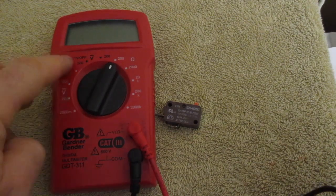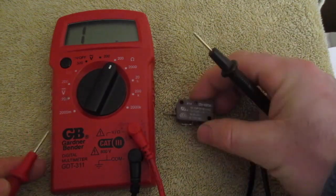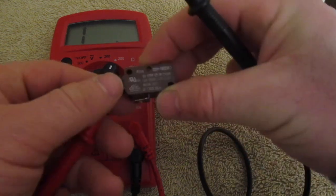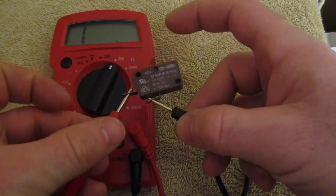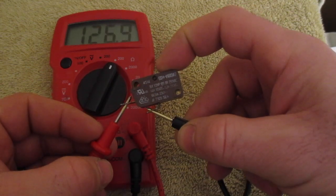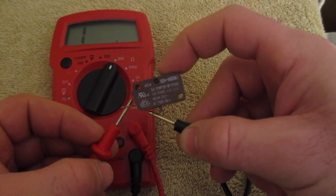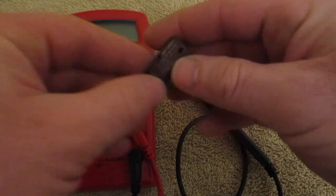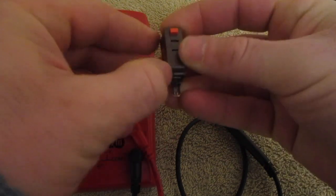While I was testing these micro switches, I did find one that's faulty. I have my multimeter set to 200 ohms, and I'm going to hook these leads up to these terminals. I'm getting no reading. When I push this down, it should read about 1 to 1.2, and as you can see, this is a faulty switch. So we're going to take this one apart to see what's wrong with it.